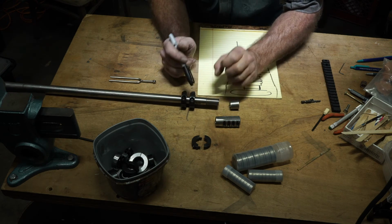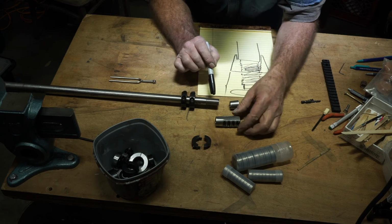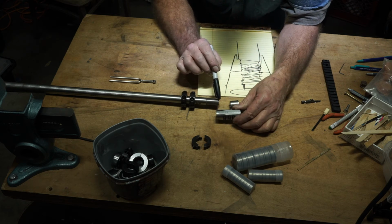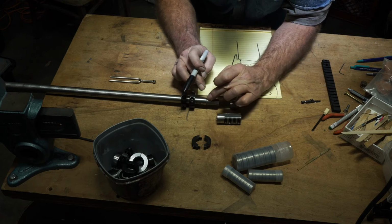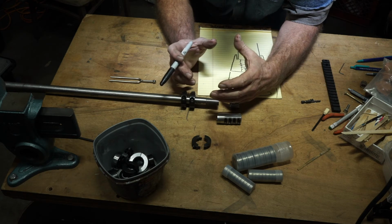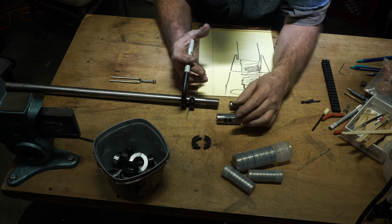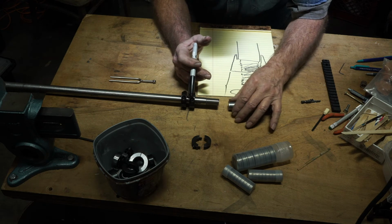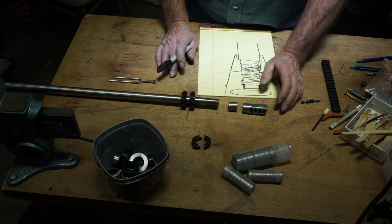That particular barrel absolutely has expanded. So I never do that. So we have the jamming surface up here, but back here we're limited in our facility because if we make too big a step here, a big jamming step, we risk this being small enough that the bore expands. So I'm bringing these things in just to bring you up to speed on some of the things that we think about when we're talking quarter minute and less rifles.